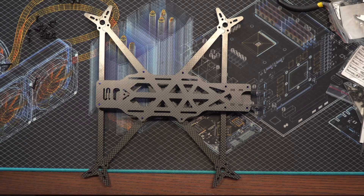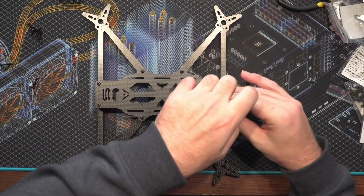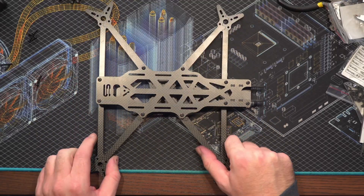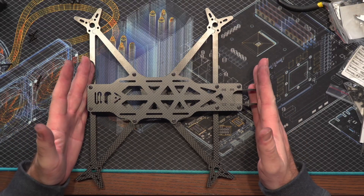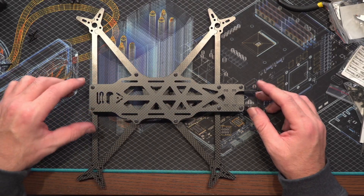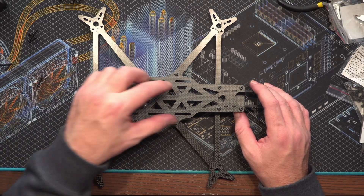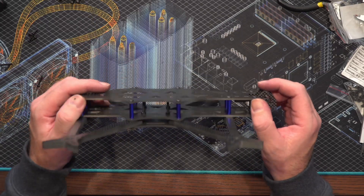You have these pre-cut plates designed for DJI cameras with two areas, as well as standard FPV cameras too. These slot into the frame at the front, and then the top section clips into these and you screw it in place. The build is together — it feels very nice and solid. Without the motors on it's not 100% yet, but it is certainly a beefy frame. The nice thing is it gives multiple options for the VTX: you can mount it at the front close to the camera, or at the back, though each option comes with cable-length trade-offs.